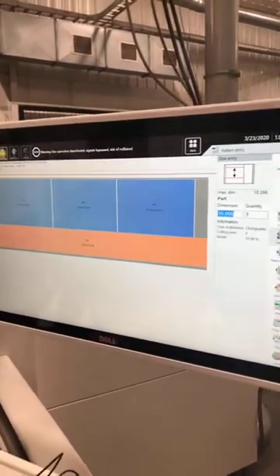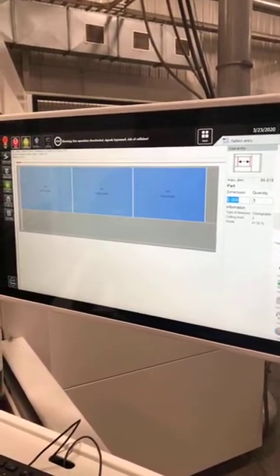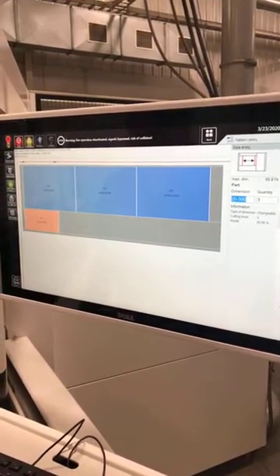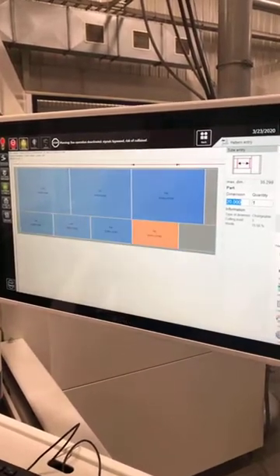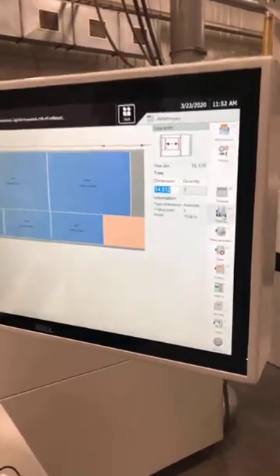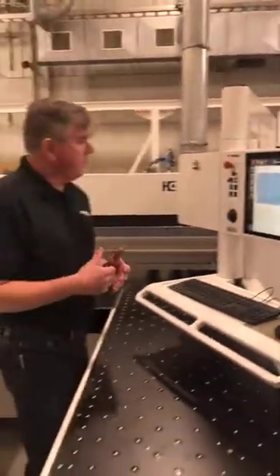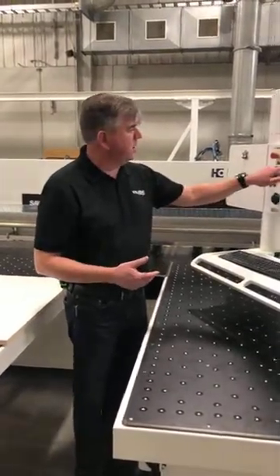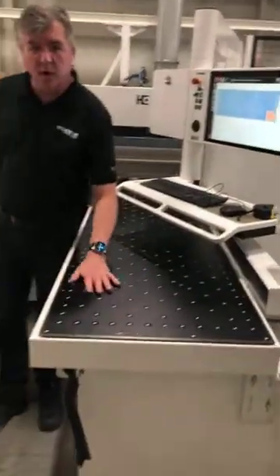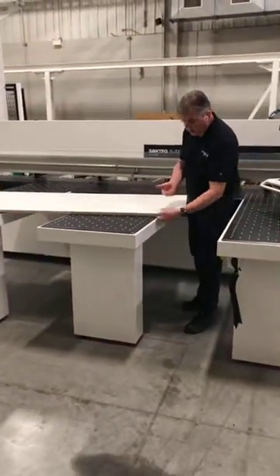From here I can cross cut this one — I want one at 20 inches and I'm going to copy that across. For this last piece I'm going to do a 12-inch piece and I'm ready to go. As an operator, my machine is referenced and I'm ready to turn on. I turn on my air cushion here, which turns on my air table. The air table allows it to float the parts so the operator isn't straining to move them around.